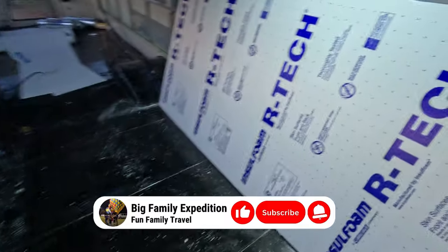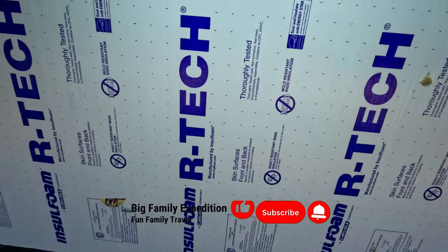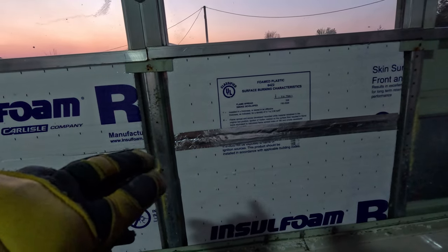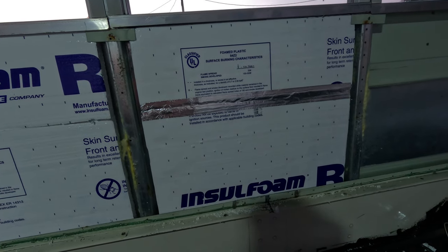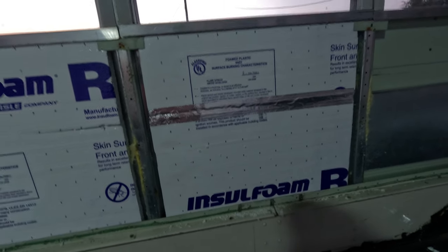There, that's better. Now that we have all the insulation picked up off the floor, we're gonna pull the new insulation out of the garage, start cutting it to size, and putting it on the wall pieces. Okay, this is what we're doing. We have this foam board insulation, and one side is a foil backing. We're cutting it to size just to fit in there. And we do have to make two pieces so that we can get them in there. And then just run a piece of foil tape over the top of them. And we'll probably finish this up tomorrow. We're gonna keep working tonight, but it's gonna get dark, so it's gonna be hard to film in here with low light. And we'll give you another update tomorrow.